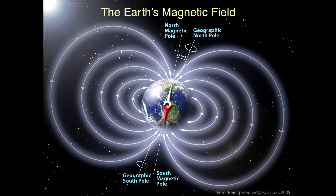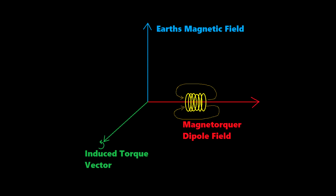While on the subject of forces due to radiation pressure, there are other schemes for applying rotation to a spacecraft. If you're in the Earth's magnetic field, there is something called a magnetorquer — nothing more than a set of electromagnets that you can apply a current to. They generate a magnetic field, and because you're in the Earth's magnetic field, the spacecraft's field will tend to want to align with it, allowing you to control attitude. These are great for low Earth orbit satellites and fantastic for things like CubeSats, where you don't need any moving parts and they're very simple to build. They aren't particularly useful once you've moved beyond the Earth's magnetic field.